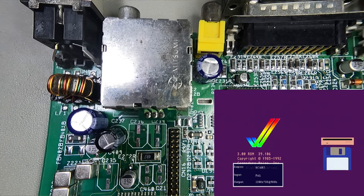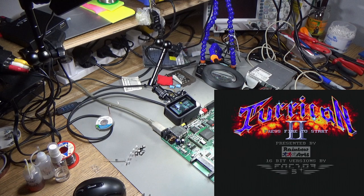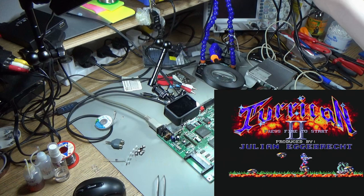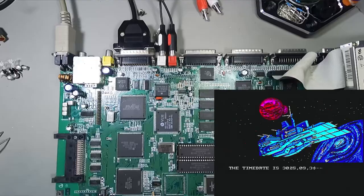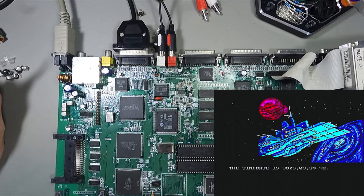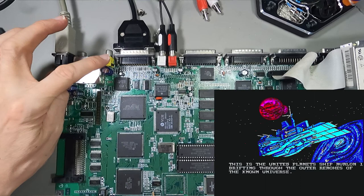Something's happening... yeah, we got the boot screen! Cool, so nothing's blown up. Let me plug a floppy drive in — the computer's working. I'm not capturing the sound but I do know it works; I haven't replaced any sound caps. Yeah, the sound's on — nearly deafened myself. So that was really all we needed to test: that the 5 volt was working and that video was working, because all these caps affected the video. And these four I haven't replaced are clearly having no effect.